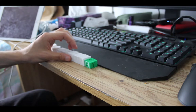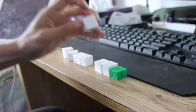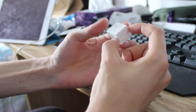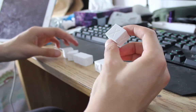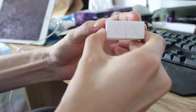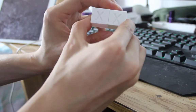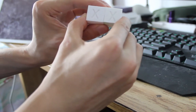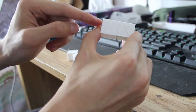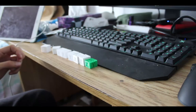So I thought maybe there's an easier option of increasing the step for Z. And this is the result — you can see that everything is stretched out. This is not what you want. So even though both of these are 20mm correctly in height and pretty flush, this one is actually the correct print and this one is just stretched out. So I just put it back to the default step.